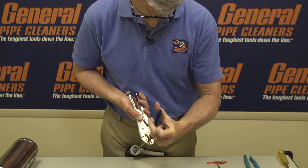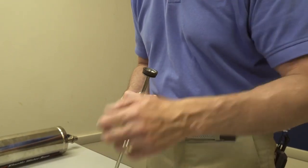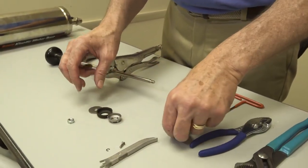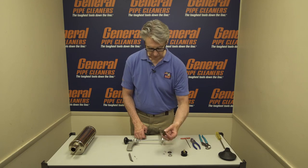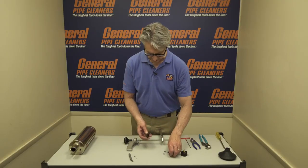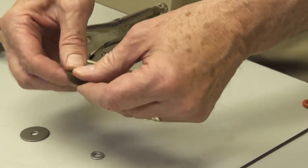Use just a pair of pliers to remove the nut. Here's the nut and all the pieces — and all these pieces are included in the Ram Repair Kit, so if there's anything wrong with them you can replace them. This is probably the most important piece in the Kinetic Water Ram. If this has failed or is not working properly, you can't build pressure. We'll put it back together again since this one's fine, using the leather cup from inside the kit, and assemble it.